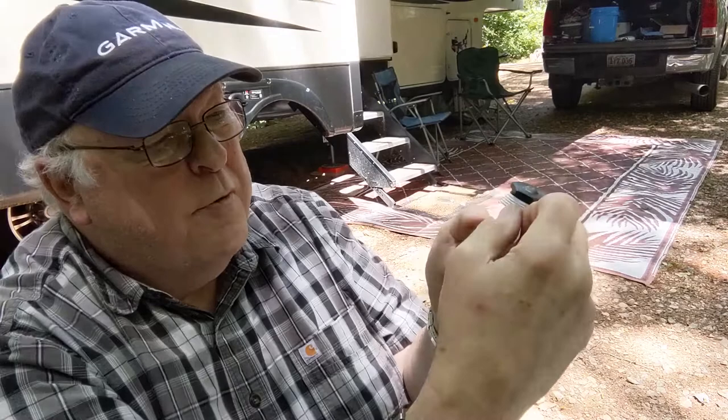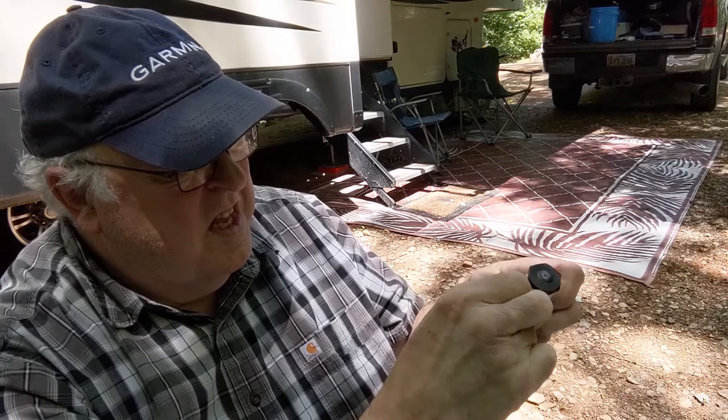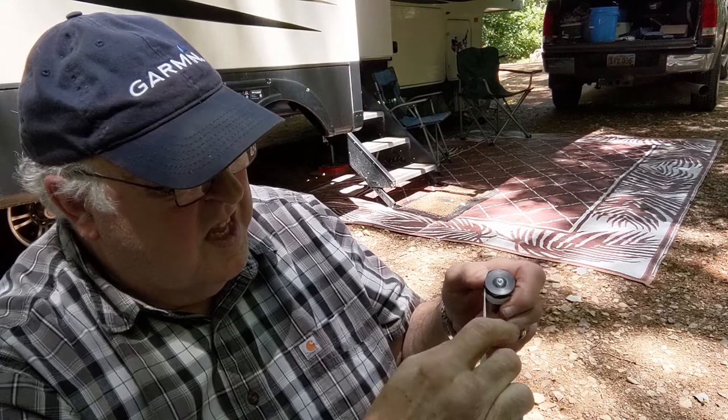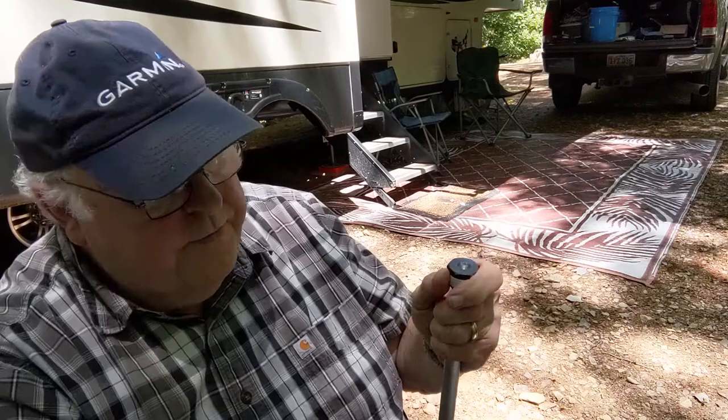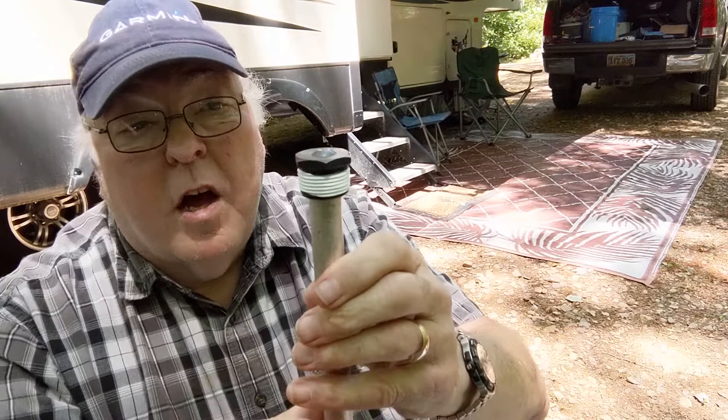You can see what I was talking about — the bottom thread or two I'm not putting any tape on. We'll go around maybe two times; that should be plenty. You can see I've got the tape around the rod but none on the very bottom thread. That's pretty important, especially if you're working on a system where the plumbing is smaller — you really don't want little pieces of Teflon tape floating around in your plumbing.